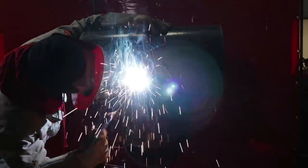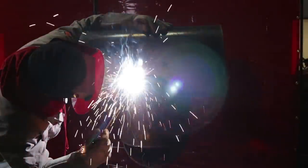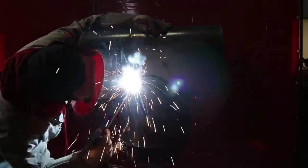Again, we're using the Blackface 87 SA200 for this. Every machine kind of runs differently, but these are the temperatures, the settings, everything for the branch that I'm doing. Same thing on the opposite side, just whipping it nice and tight, okay? If you get inconsistent on that whip, the cap is gonna kind of look, of course, inconsistent. So make sure when you're whipping it, it's nice and the same. Because when you wire wheel it and everything, it's gonna come out really nice. Make it look presentable.